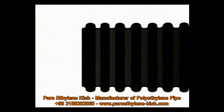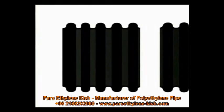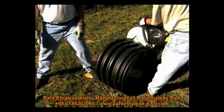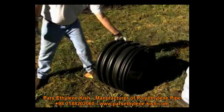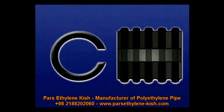To make an installation stub, cut a section of same diameter pipe five corrugations long. The pipe should be cut in the center of the valley between corrugations. Once the stub is cut, make cross cuts to remove a thin strip of pipe material so the stub will compress to fit inside the bell of the pipe to be inserted. Always be sure to insert the full corrugation end of the stub into the bell.